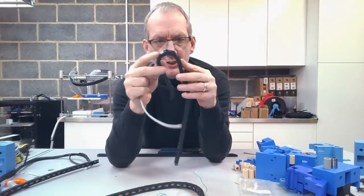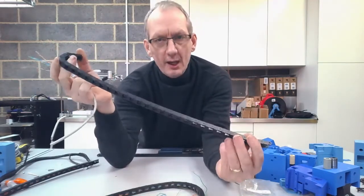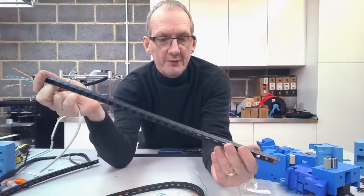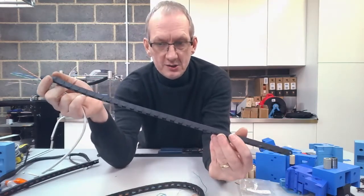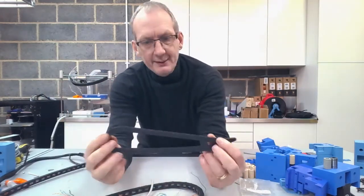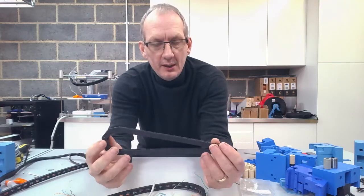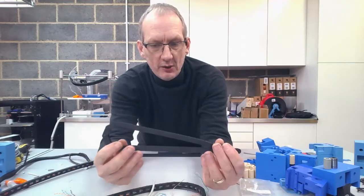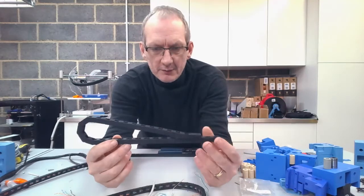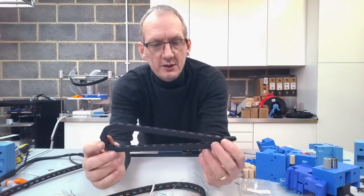I've tried some different sizes of energy chain, but the reality of it is I find this one here, which is labelled up as 7x7, which internally is 7mm by 7mm. That's what the 7x7 means. I'll provide a link in the description on where you're able to purchase this energy chain from. Now, normally it's sold in 1 meter lengths, and unfortunately we need just over 1 meter in order to do the entire energy chain requirements for the Printtable. So you will have to buy 2 lengths, but depending on where you are in the world, you may be able to buy this for as little as $8 or $10 for each piece.